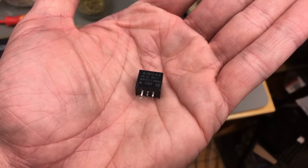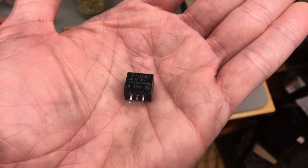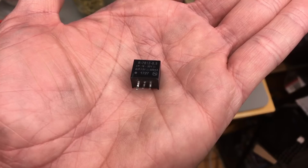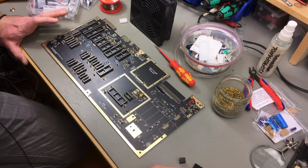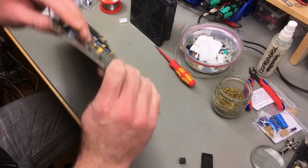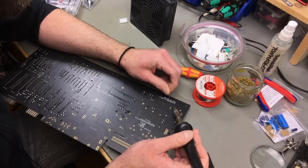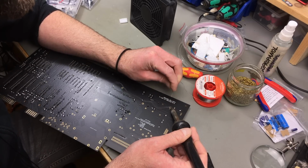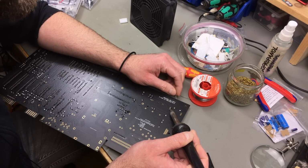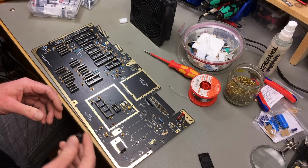And this is kind of the 12V equivalent, R7812 0.5, so this is half an amp and the other one is 1 amp, so they should be equivalents to the original parts. And I actually don't know if this is going to work, but I'm going to try. That's the whole point, I guess. And these also run a lot cooler because they are way more efficient than the original linear regulators, so they don't need a heatsink. And they should produce very little ripple because these are quite expensive actually, good DC to DC converters. I think you could get away with using way cheaper ones. But I kind of want this to be nice.